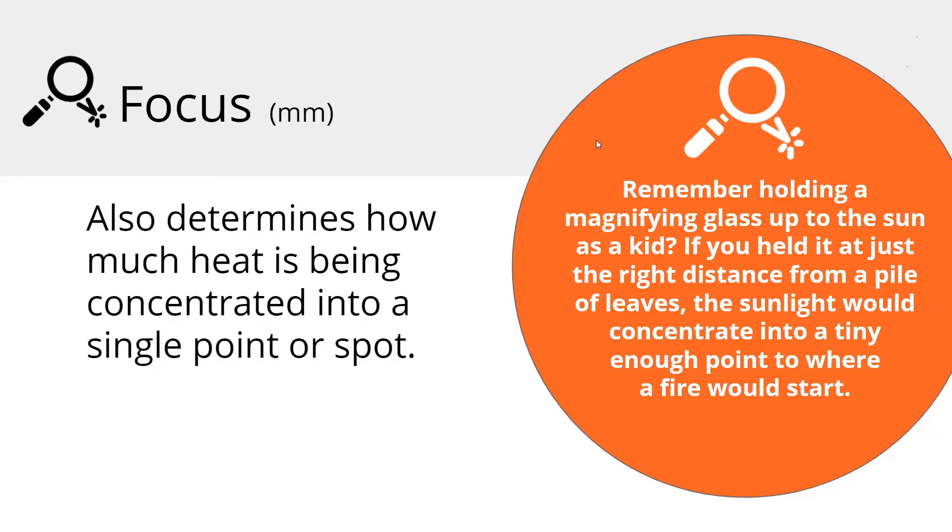There's a question: when you hit the autofocus button, is that automatically setting it at a two-inch focus? The answer is yes — that's what autofocus is doing. It is set to two inches because that's the lens that's in there. In the machine, if you put a 1.5-inch lens, there's a space for it in the lens caddy on the bottom spaced exactly half an inch underneath the two-inch lens. So if you decide to use a 1.5-inch lens, you can still use autofocus — it'll still create the correct distance because the lens is moved half an inch below, keeping the same effective focal distance.